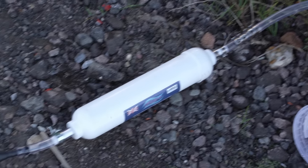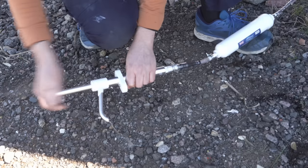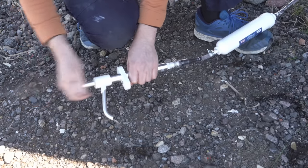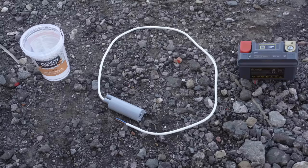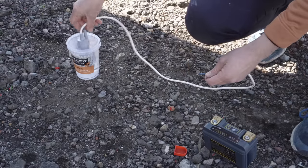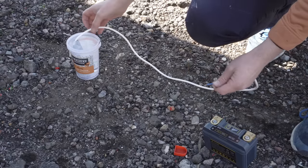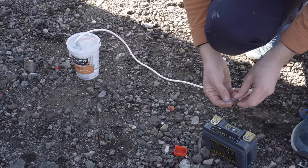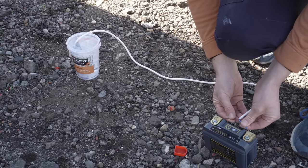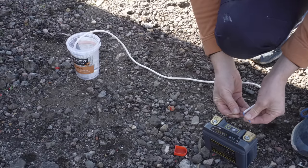The carbon block filter is a tough obstacle for water, and it needs considerable and constant pressure. I don't want to downgrade to a granulated carbon filter, as block filters perform better when compared like for like. Right, so Alan! Avoiding electric power with this length of hose plus the block filter isn't going to happen. I've got myself a 12-volt submersible pump and a spare. This, whilst connected to my little lithium FE battery, gives a serious surge. And a surge is what we'll need, because there's distance, two filters, flexi pipe, and all manner of twists and turns to negotiate.